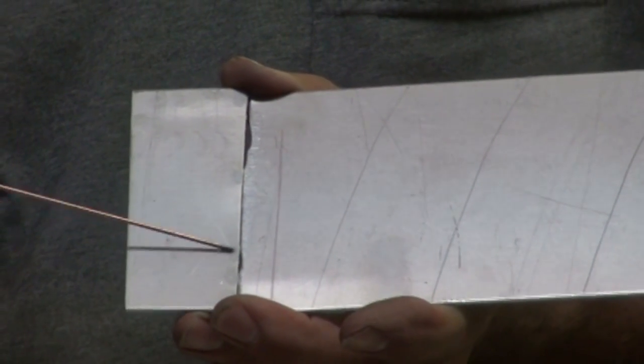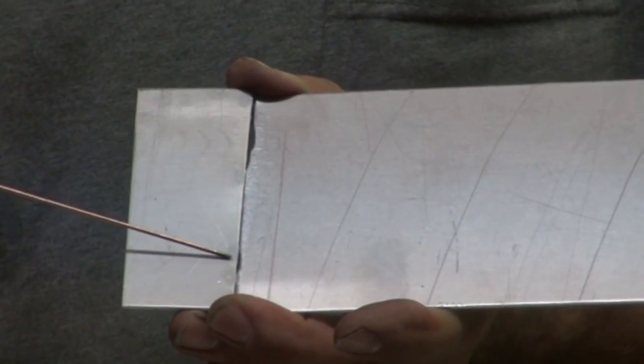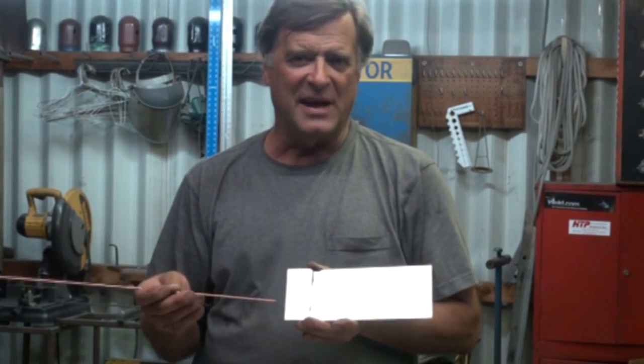If my fit is not quite right — which is the way it normally is — if I've got some little gaps in there that I'm going to have to fill in, I'll bump up a size. I can go to the 3/32 filler wire for the TIG welder, or the .030 in the MIG welder, just to give me a little more metal I can dump on the weld. But if I've got a big old gap, a real big mess I'm trying to stick back together, then I'll go up to the 1/8-inch on the TIG wire, or the .035 or .040 for the MIG welder, just to give me more metal to fill in those gaps.